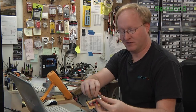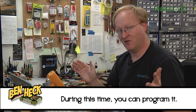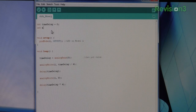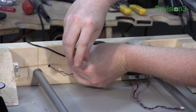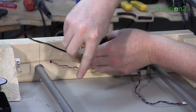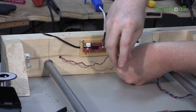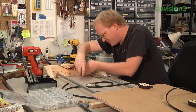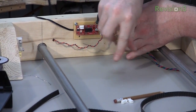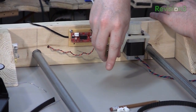I'm using the DigiSpark version of Arduino to program this. It's going to use the knob for really slow time-lapse or fast movements like a slow pan. There will be min and max switches so it doesn't go past the edges, and a button to start or stop the sequence. Time to install the driver board into the frame. I've put Molex disconnects on all the plugs so it's easy to hook up the limit switches — there's a minimum and maximum. The minimum switch is for homing, and I ran that wiring through the conduit.